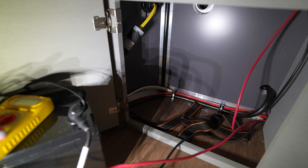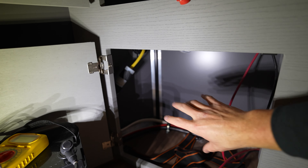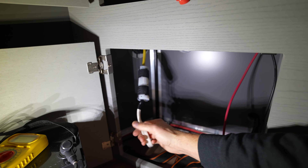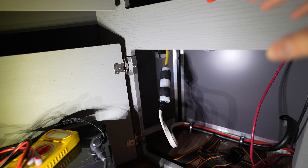But here's the great part — now we're going to put our two batteries here, get them wired up, and then we're going to have an inverter which I'm hopefully going to be able to fit down here in this cabinet as well. Then what I can do is just unplug this and plug it right into the inverter. I've got the power converter turned off so it won't back-feed into the batteries. Everything's starting up — that was plugged into power so it's definitely working. Getting the batteries in here and getting things wired up is the next step.